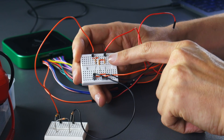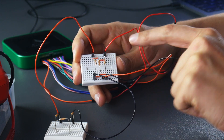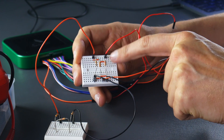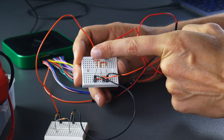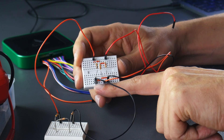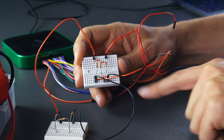I actually like this in particular because oftentimes when you're looking at a circuit, it may be one node even though it goes here and connects over there and connects over there, but you realize there's nothing in the way — that's still one node. Even though we have different holes and a whole bunch of stuff going on, electrically all of these things are the same because they're all connected together. Electrically, these three are at the same voltage level because they're all connected together.